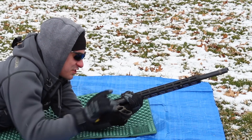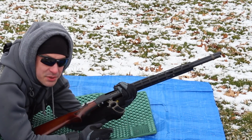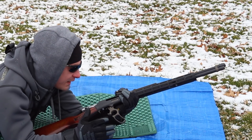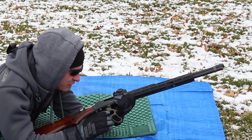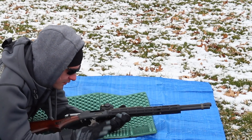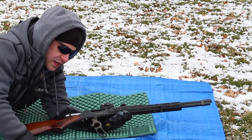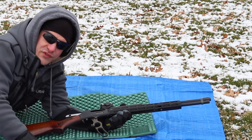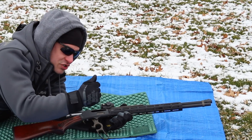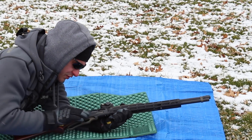This is really cool — this is just a cool project, a cool rifle. Going in there and watching disassembly videos on YouTube and just kind of breaking edges — obviously if you have no skill level, don't do that. I did that apprenticeship with John Robinson for two years in gunsmithing. It's not too hard as long as you don't go too crazy. Just slide everything — take the lever, take a very flat surface and drag it across some sandpaper, maybe 600 then 2000 grit. You'll smooth everything out, take those factory machining marks and burrs off. It's very pleasant to shoot. It doesn't thump you — it's just a push and the muzzle just goes. I hope everybody appreciates my sound effects — I've been working 36 years to perfect them.